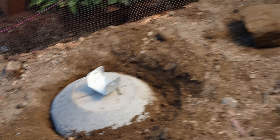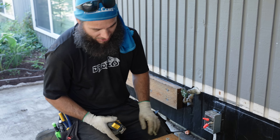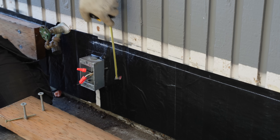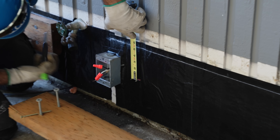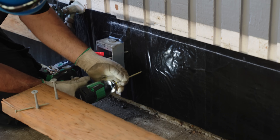Here's a quick tip: we've got a 2x6 here, but the actual measurement is 5 and 5/8 inches. So I take my line where I want the top of my board, measure down 5 and 5/8. The reason I'm doing this is because I'm by myself right now — Doc had to go do something. Otherwise I'd have him hold the other side of the board, but since he's not here, this little fancy Guard Dog 3.5-inch screw is going to work as that extra hand.